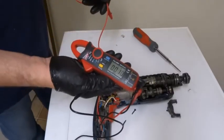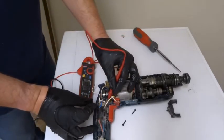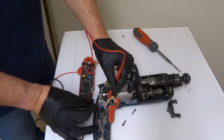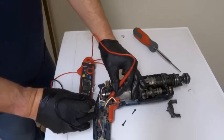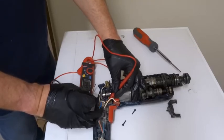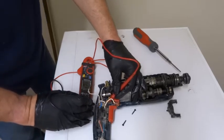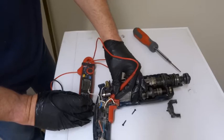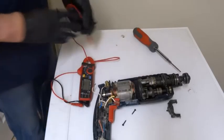I've just got this meter which reads capacitance. I've set it to capacitance and I've read across it. It's saying 20 nanofarads, so you'd have to take that off to find out what the actual reading is. As long as it ain't short circuited it should be alright. It's saying 4.9 — I'm struggling to read now. It ain't shorted, that's the main thing.